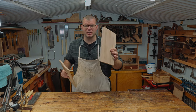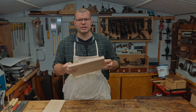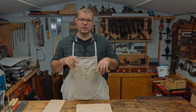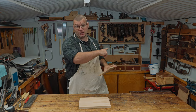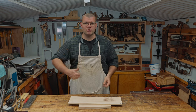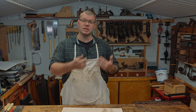For today's video I'm going to be using this 19 millimeter piece of pine for the bottom — 185 millimeters wide by 300 millimeters long. That is the initial layout of this particular tray. I've got some leftover 12 millimeter material from when we made the first butt jointed box, and we're going to cut off some 40 millimeter strips. I'll leave a list up here of the tools I'm using so you can stop the video and check.